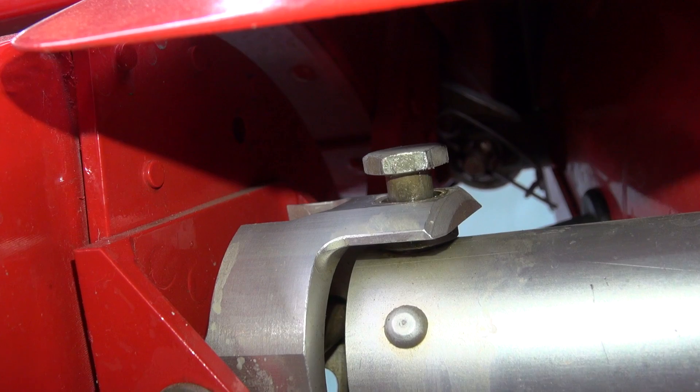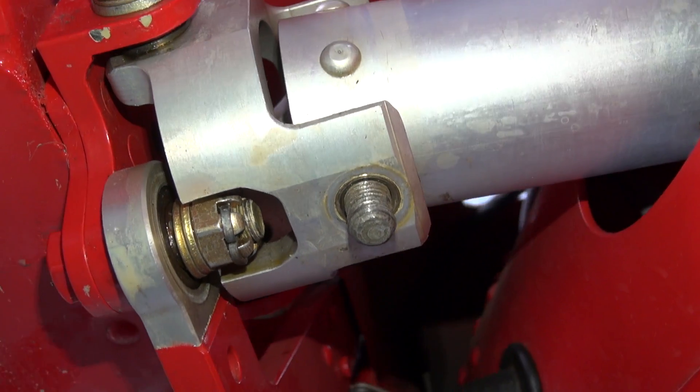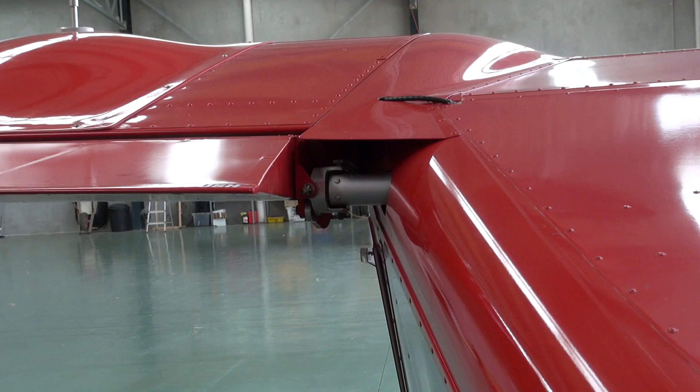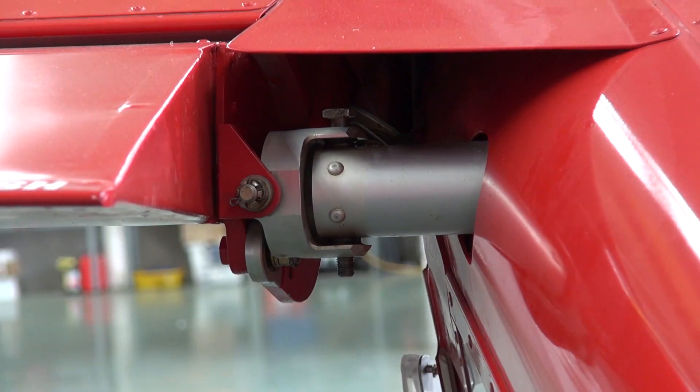The main thing to do is look very closely at the top and the bottom lugs here, where this big bolt goes through, to make sure that there are no cracks at all around either the top or the bottom of the bolt — to make sure the ring is fully okay and there's nothing wrong with it.